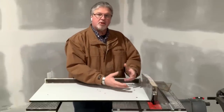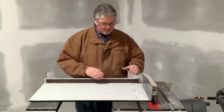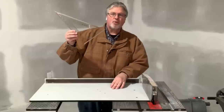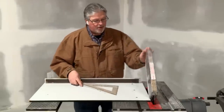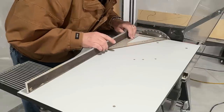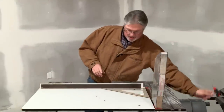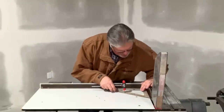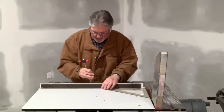How do you align this thing is the big question. The miter bar has a little bit of play when you loosen the three cap screws that hold it in place, so we can get a little bit of adjustment there. Once we have it close, we can really lock it in by adjusting the fence. One of the best tools for that is just get yourself a good aluminum square or drafting triangle — inexpensive, pretty accurate. What I typically do is position it against two carbide teeth. We can move the fence until we're happy with that alignment, and then lock the fence in place.